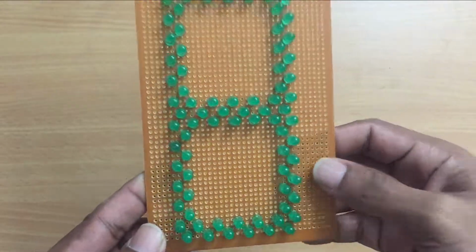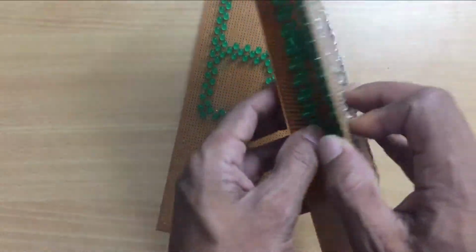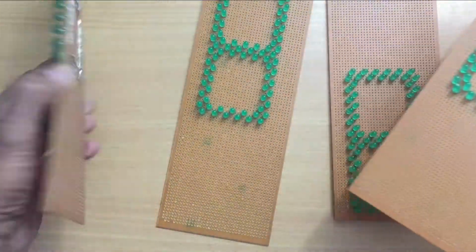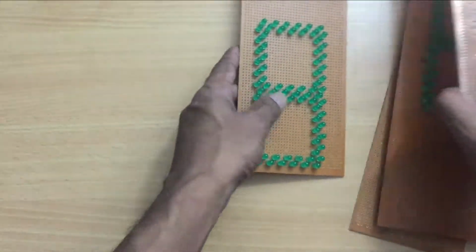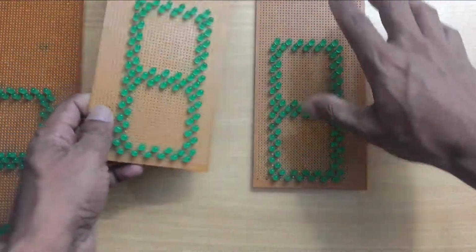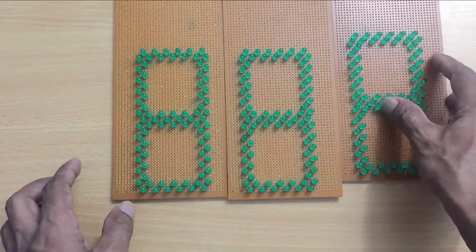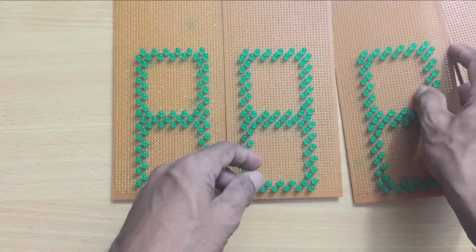You can see the completed seven-segment displays with the LEDs. There should be 8 of them using LEDs. The additional zeros you can cut down. And before starting the project, you have to test the LED connections, solderings, polarities, etc.